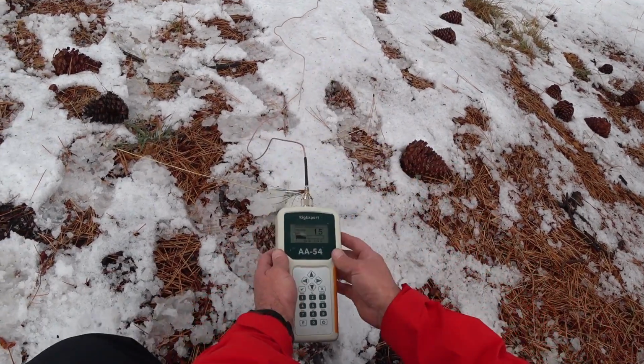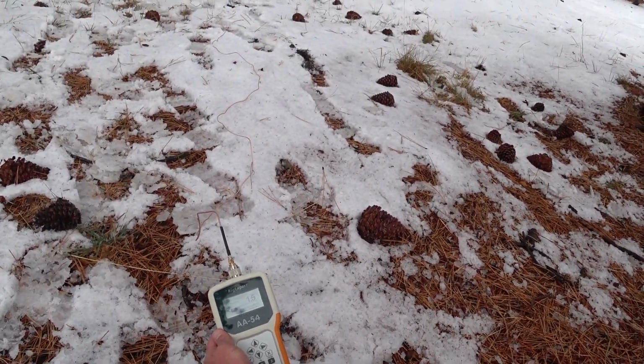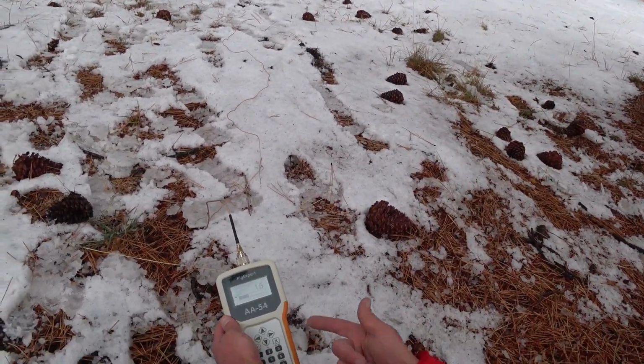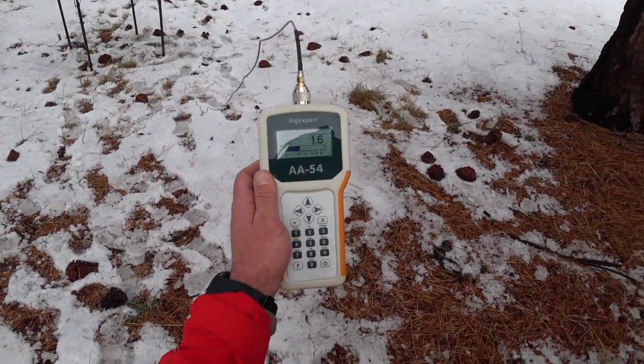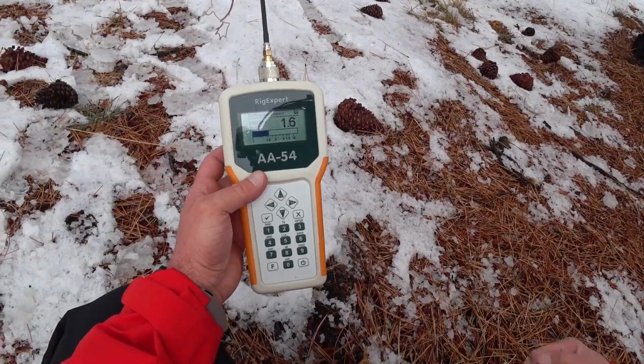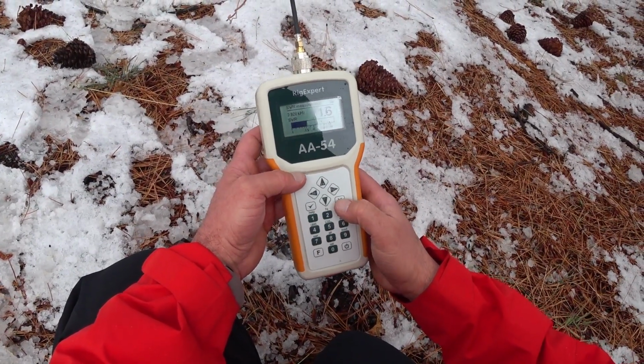But here, you know, you can't get much better than that. So that 9-to-1 is working perfect. Random wire. This is my coax. If I take this up off the ground, I'm at a 2.3, 2.4. Let's see what we can get with the other frequencies.